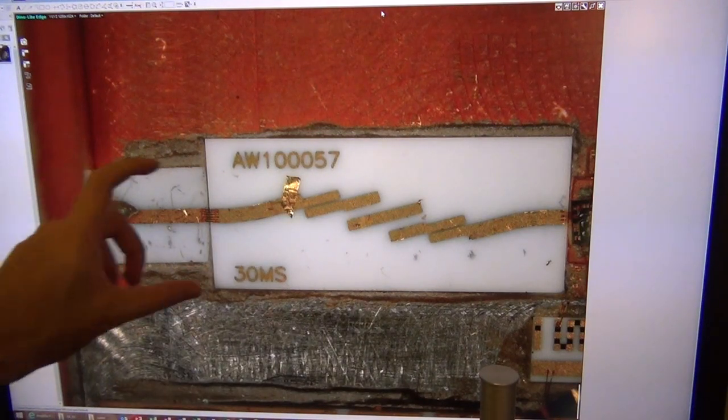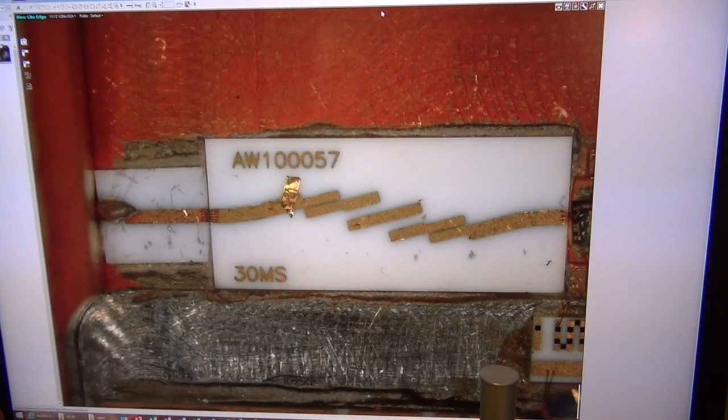It's because they want to filter out all the frequencies that the PA cannot process, because otherwise the PA is going to be overwhelmed by frequencies that are out of band. So this is most likely some narrow band filter. It could be maybe from 20 to 40 or so.